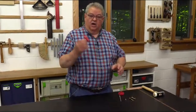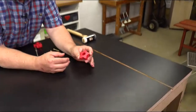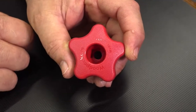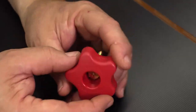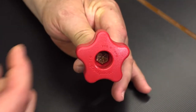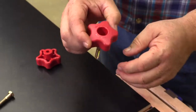I'd like to show you a different approach. Woodpecker's multi knobs are designed to be either a stud or a nut — either one. What we've got here is a fiberglass reinforced hex recess in the bottom of that knob, and there's a taper to it. So you can take any bolt, drop it in there, and it falls into that taper. Now you could just go ahead and put this in your jig, tighten it down, and it'll pull the head down into that taper. Or if you're impatient like me, you can take a drift and just tap it a couple of times, and it's good to go. It will never slip. It will never strip out.